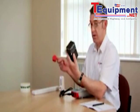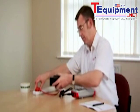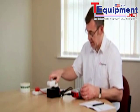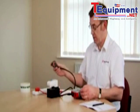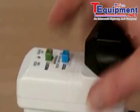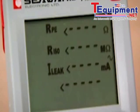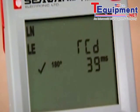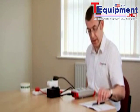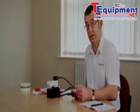The non-trip adapter is plugged into the main supply. The portable RCD is then connected into this test supply and the test instrument plugged into the RCD. We then reset the RCD so it's ready to be tested and we press the RCD test button — the RCD trips. We can then make a note of the operating time in our PAT testing logbook and label up the RCD as tested.